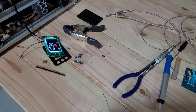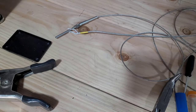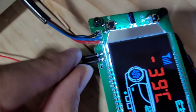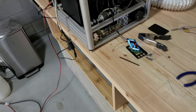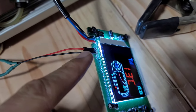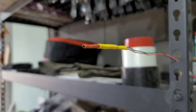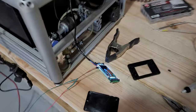I figured out why it's not working — this is a thermocouple, but this unit needs a thermistor. So if you want to buy a replacement for it, you need to get a thermistor, not a thermocouple. I have an Arduino kit with a bunch of wires and extra accessories, so I'm going to solder these two wires and then at the end I'll hook up two more cords, run them about 10 feet, and plug in the thermistor. I got it all hooked up — I soldered the wires, spliced it, and the wire is about 12 feet long.